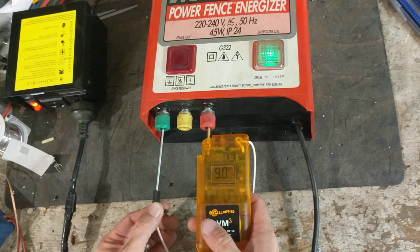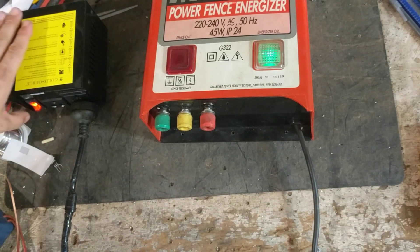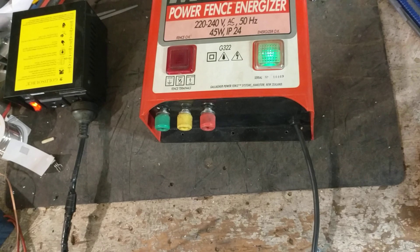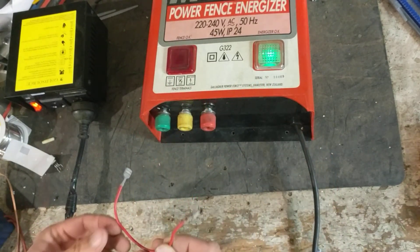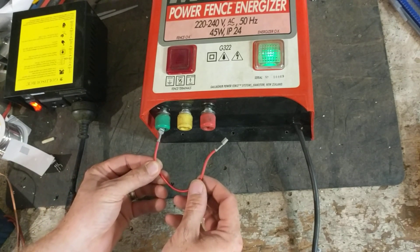This one's putting out 9,000 volts at a 37 stored joule capacity — that thing packs quite a punch. I'll open it up in a minute, but I'm going to put a jumper wire across here and show you the blast of shock this thing throws. There are bigger ones out there now — there's 50 joule stored, there's 58 joule stored by Gallagher, and SpeedRite's got some big ones too. But for its time, it was a big, big unit.